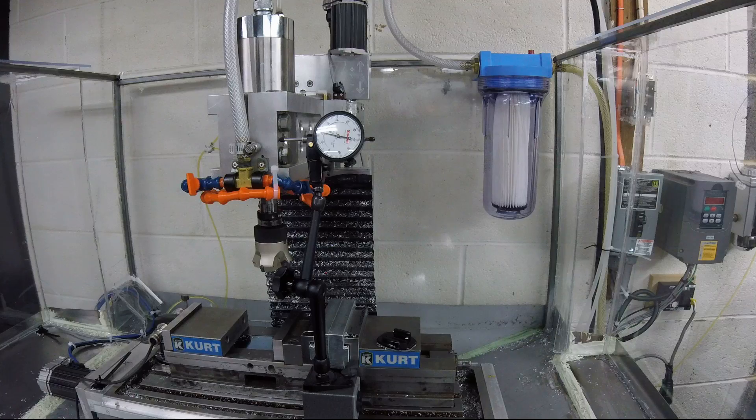If you don't take the time to do this, you're just wasting your time — you're going to make crap parts. The machine doesn't know that it has lash, and all machines have lash. All ball screws do. These are supposed to be zero-backlash screws and you can tell they are not. I've got about a thousandth on the X, which is not good, but it's just within the threshold of me being able to use the backlash compensator safely. If you're over, say, two or three thou, something is wrong.